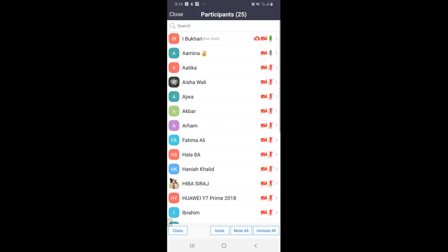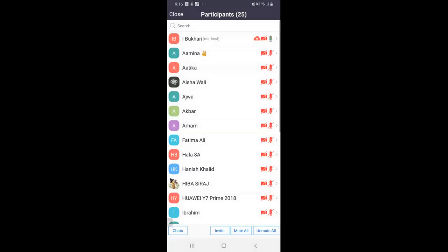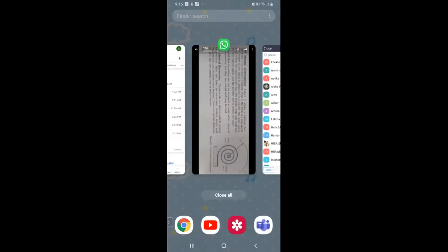See, you will immerse the bimetallic strip first in melting ice. Not the needle, not the pointer, the bimetallic strip. I mean, the pointer is also along with it. So when the brass contracts, the whole thing will uncoil a little according to the temperature, okay? Because of the contraction of brass. Okay, whatever expands more also contracts more. So because brass expands more, it will also contract more than invar. And as it uncoils, the needle will point towards a position. Now that position we will mark as our ice point, okay?